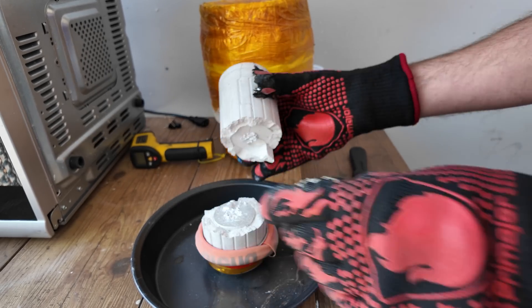I did make another mold but I messed it up in a different way. Funny enough, 90% of the mistakes I make I've made before — which probably means I should print a list and stick it on the wall saying 'do not make these mistakes again.' What was the mistake? I opened the mold before the aluminum had solidified.